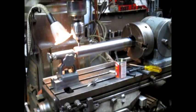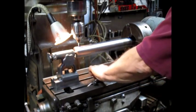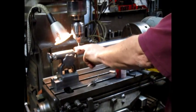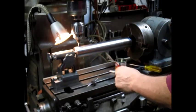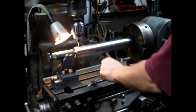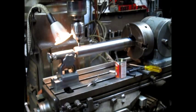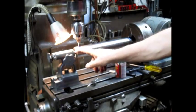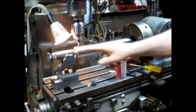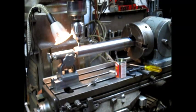Okay, so we'll crank it up, do 32 more holes there, and I'll keep you with me. First, we're going to, of course, go in and hit it with the countersink to center that hole and go all the way around, and then come back with the small 063 drill bit, number 56, I believe, and put the series of holes in that part. Then we'll come in and go 4 inches and 4 inches, and we'll be done with that part.